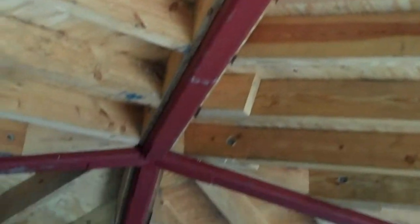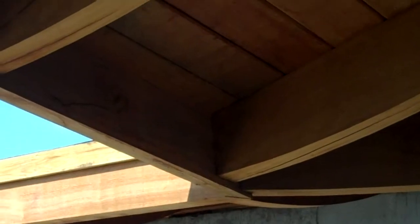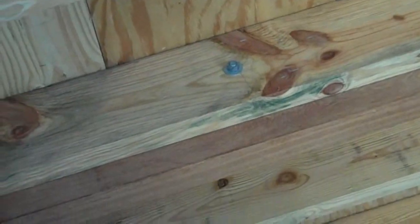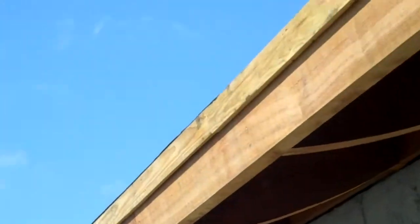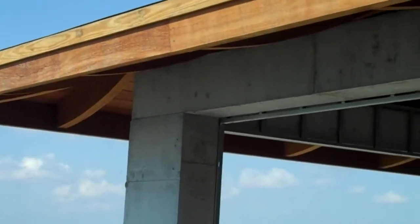You also have metal on the stretcher and the way they connect the wood on the inside. You can see it's all been bolted together, and this truss is not one piece because of the way they created the overhang — it's a really nice material overhang that is going to be exposed tongue-and-groove. This is a 2x tongue-and-groove, and this is on the waterfront where the hurricane-resistant construction is being detailed.